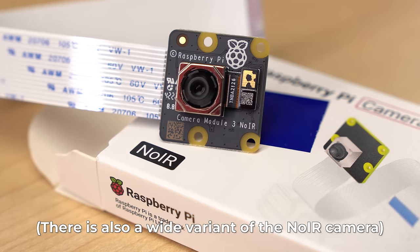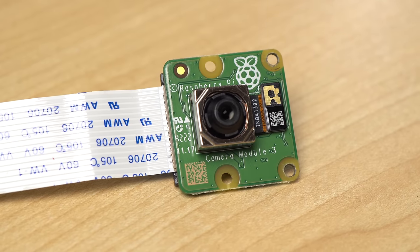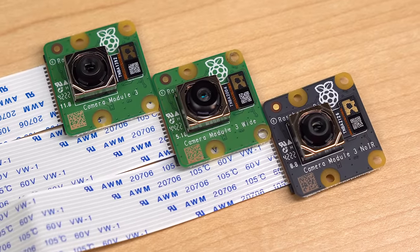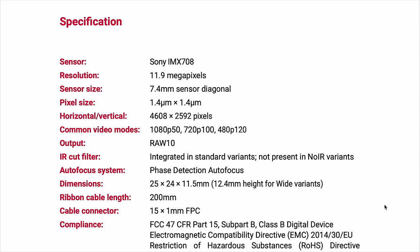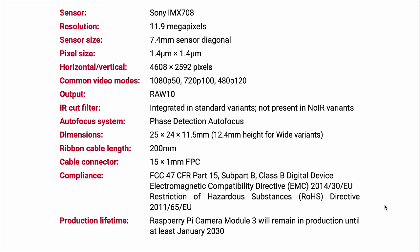I haven't tested the no-IR camera yet, but I'll leave that for a future video. In general, I've only had time to take a few hundred pictures so far. The sensor is very good, almost on par with the secondary ones on my iPhone, but the lenses are a bit lacking — they don't do the sensor justice, so you waste a bit of that 12-megapixel resolution. With the right lenses, the high-quality camera is pretty much tack sharp, but with a similar-sized newer sensor, the built-in lenses on the Camera Module 3 just can't resolve a full 12 megapixels of detail. But they're decent, especially considering the whole thing is $35.